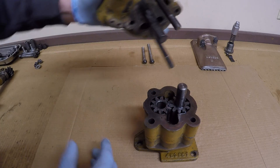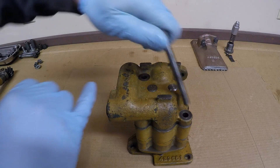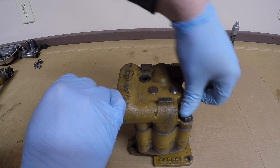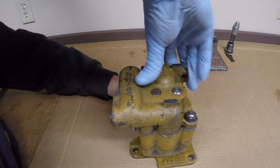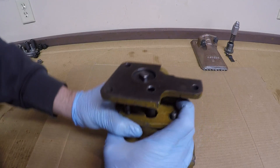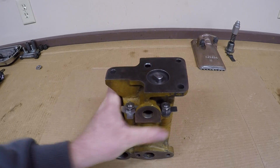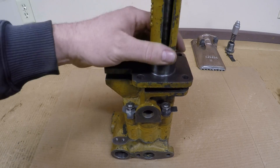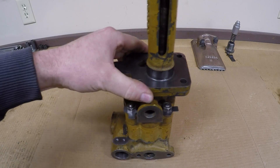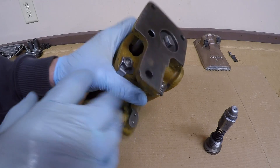Anyhow, got that out of the way. The pump base with two of the four studs and the idler gear shaft can now be installed. Install the two alignment studs through the body — lightly oil each one; you don't really need grease on these. Flip it over, install the four nuts with new locks properly positioned beneath them. Before you make it permanent, make sure you have a good spin — no bind, no clash. The easiest way to do that is just to set the drive unit on top and check it by hand. Sounds like a pump and it spins well.